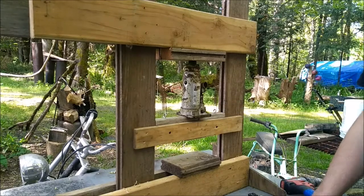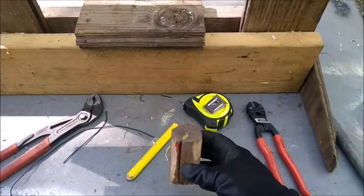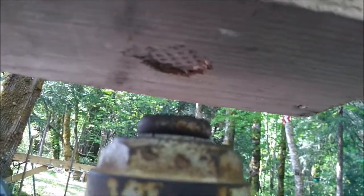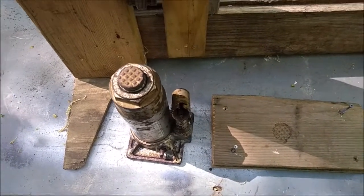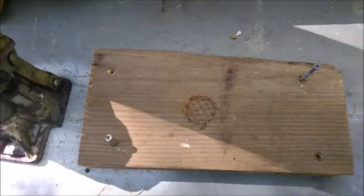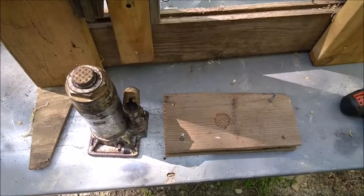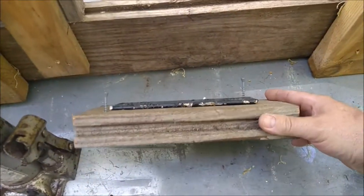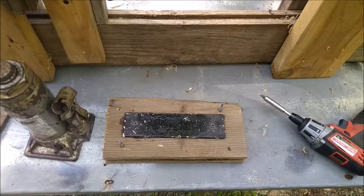Now we need to crush something. I tried to crush this little piece of wood — smush it down. That piece of wood has a larger surface area than the piece of wood this jack is pushing against, so I'm going to need some metal up there. That waffle pattern on the top of the jack made a real nice indentation — almost a quarter inch deep — into the piece of wood. So I'm going to have to get some more metal. I put a random piece of metal I had lying around on here, drilled some holes, screwed it down. It's 3/16ths of an inch thick, so now something else will be the failure point — this part should hold.